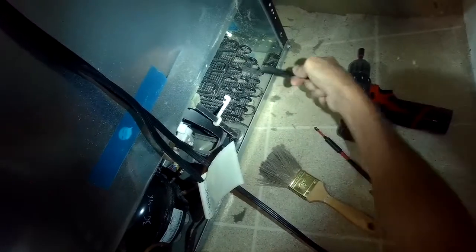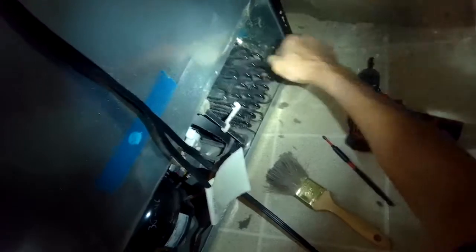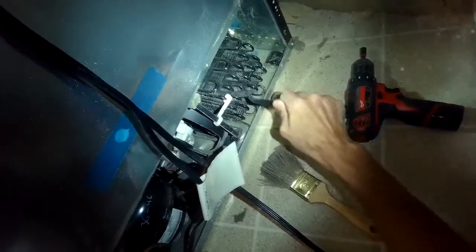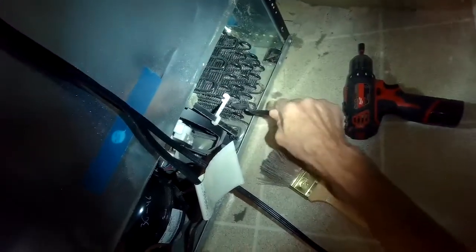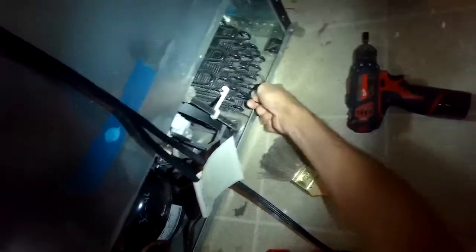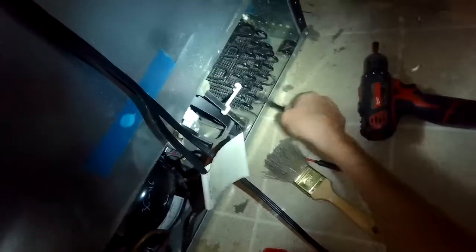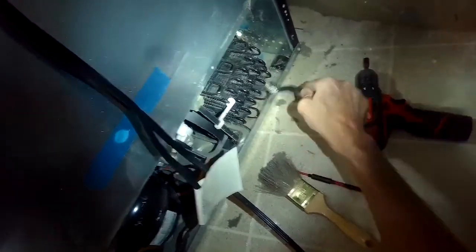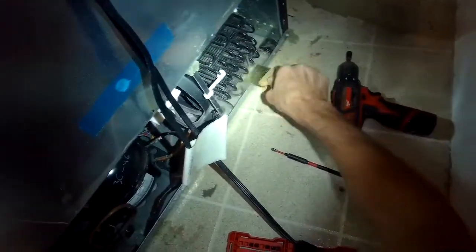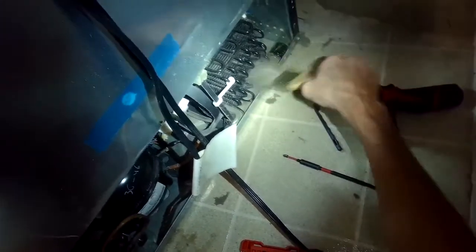So refrigerators are all about their ability to get rid of heat, taking heat from inside the freezer, and the system pulls it down into this area, and a fan blows on these coils and dissipates that heat, gets it out of the area. So having your refrigerator too close to the back wall can be trouble, because it's harder for that heat to leave the refrigerator. So creating a little bit of space is good, and making sure that in front of the refrigerator where that grill was is clear helps, because that's where a lot of the airflow goes.